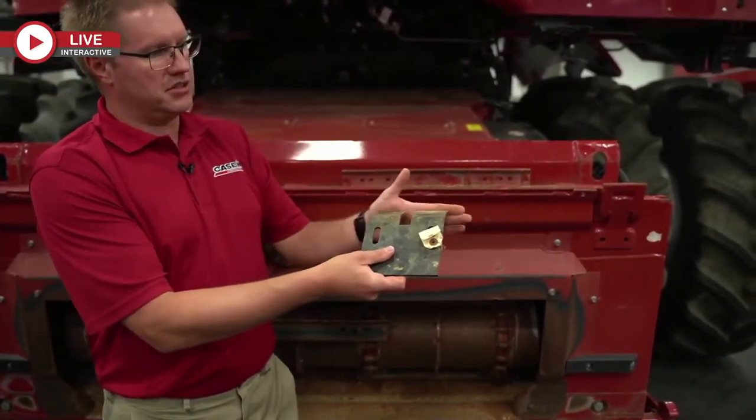The other thing to watch with this belt over the years is it actually tends to wear out before it ever breaks. As the belt narrows, it'll sit further and further down in the pulley, and when it reaches the bottom it will start slipping. The cleaning shoe has to slip 20% before the alarm comes on — you could be slipping 10% right here and never have an alarm, basically losing 10% of your cleaning shoe capacity. Make sure that belt's always in good shape.